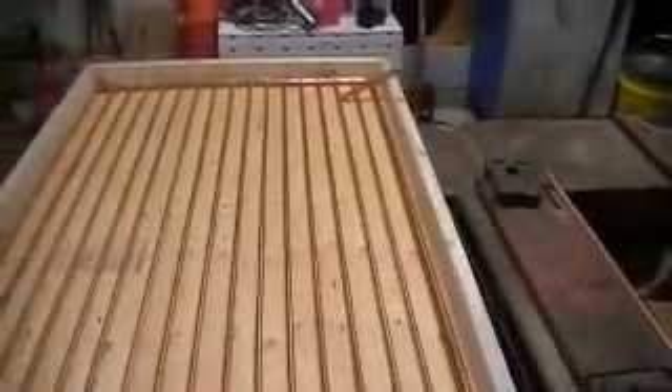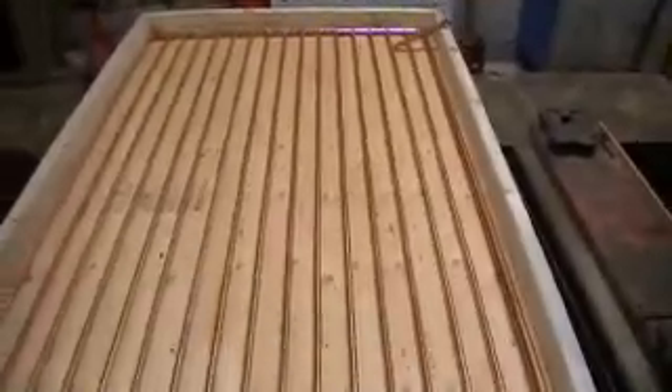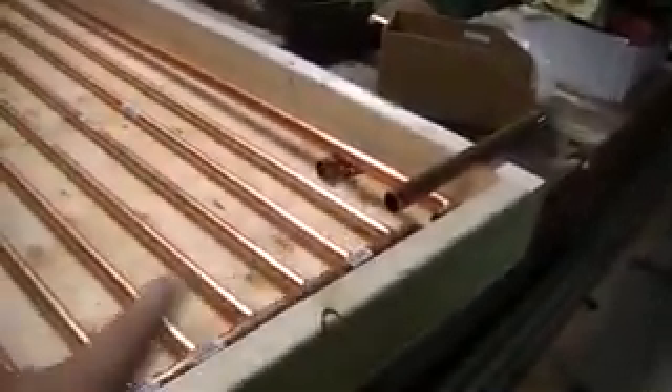There are a whole bunch of different ways you can build these boxes — I don't think there's any right or wrong way, maybe some are better than others. I chose to just put the two-by-fours right on the plywood, screwed down, and then I put three-inch screws going in the sides. I lost a little bit of space on my plywood for spacing my riser tubes. I originally wanted 20 riser tubes, but by doing this and compensating for the return that's going to stay in the box, I ended up with 16, which is a lot more than a lot of them I see on YouTube.